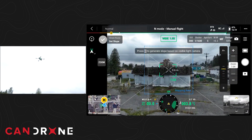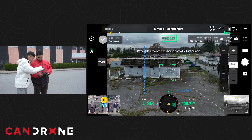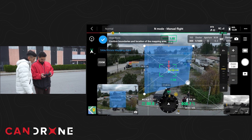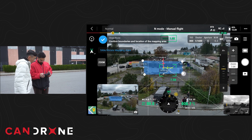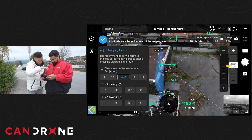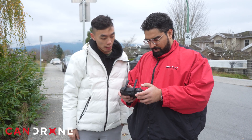The first surface we're going to do is this side of the building right here. You see this mapping area — that's defining the area we're interested in. Right now we're not able to cover the whole thing, so we're going to have to back it up. Press the C1 button. Now we need to adjust the area of interest. See this blue box — try to adjust it so it tightens up to the building structure. We need to fly forward and to the side of the building to verify it's matching that surface, and move it out a little more. Adjust the X axis — there we go. Looking good. It doesn't have to be perfect, just try to get it as close as possible.